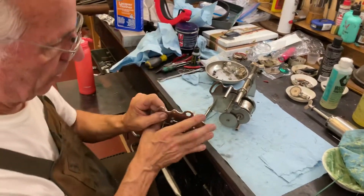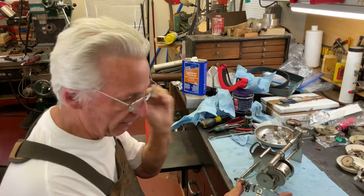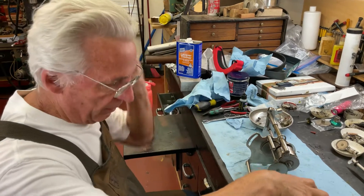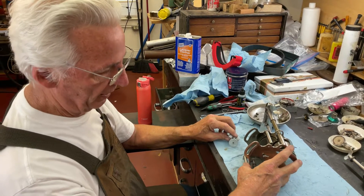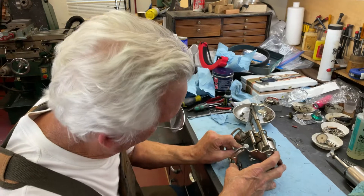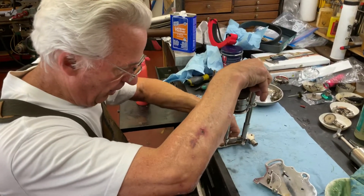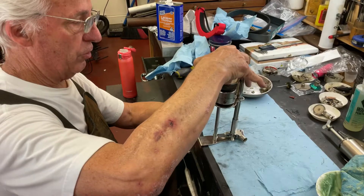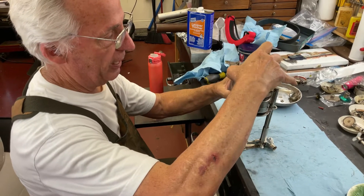Now you're going to have to wiggle all these pinion holes to all these pinion holes and insert the governor. To do that, you're going to have to start to come in here like this. Then you're going to get a little bit of play with the side casting here — the motor. You put the governor in and go like that. I usually get this all together and gently set it up on the bench. Now this all goes in here like that, and you have to wiggle — the gears will wiggle a little, but once it starts hitting, it'll just go clink.